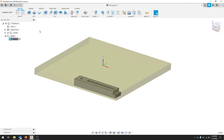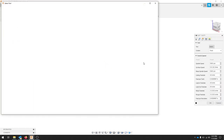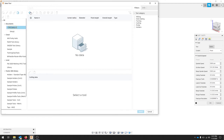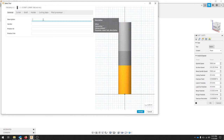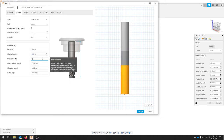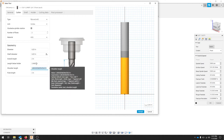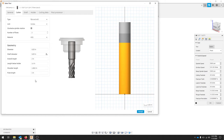I'm going to start milling out this part from stock, and the first thing I'm going to do is the slot. I'll find the slot tool. I need to add a tool into my library — let's add a brand new flat end mill. We'll call this a quarter inch two flute up cut. It's going to have two flutes, it's flat, and I'm in inches. The diameter is a quarter inch, overall length is two inches, and the flute length — which is what really matters — is one inch.